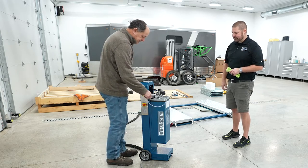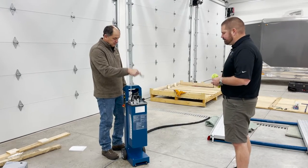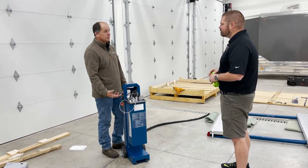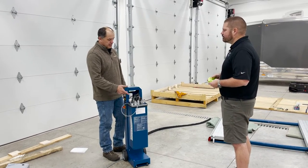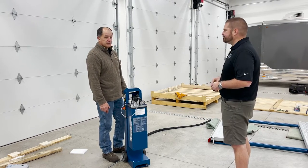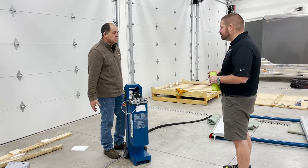Now, that makes sense. Like for example, that switch is Lovato. It's from Italy. Yeah, from Italy. The pump used to be Bosch. We started going to really, really high pressure and the Bosch pump didn't seem to handle it, going back to the early 90s, excuse me. They switched over to an Italian pump called Marzocchi. I can say the amount of pumps we replace in a year, I could probably hold right here. That's cool. They just don't go bad.